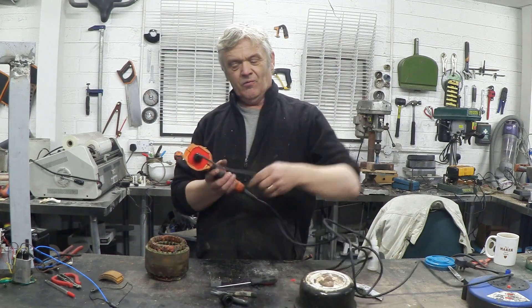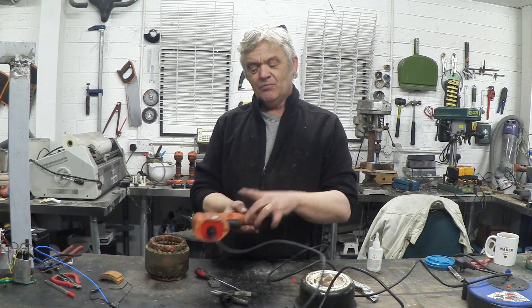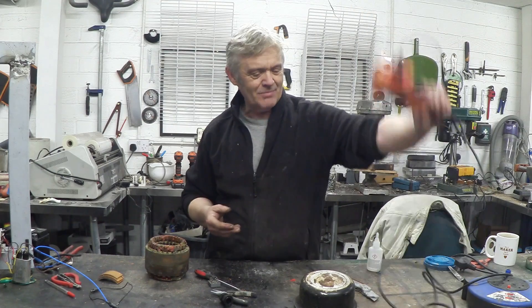That's my safety switch complete. I can plug that in, wire that up, and I can be a good distance from anything. It'll only be on when I hold it - it'll come off when I let go - and if I hold it and press that it'll stay on until I click it again. So that actually is a safety switch for a whole host of things, and I'm going to use it for my magnetizer.